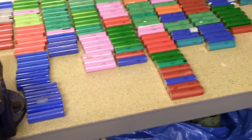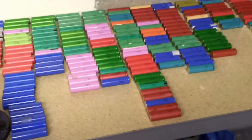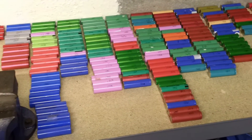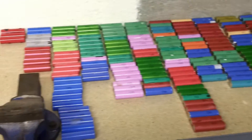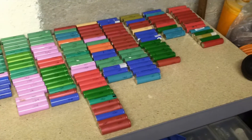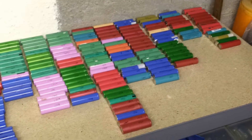I've yet to decide what sort of capacity I want based on the number of cells — it's either going to be 6 in parallel or 7 in parallel, times 2. I'm going to be making 2 packs; I've decided to go for 13 series and either 6 or 7 parallel, times 2. Each pack will be put in parallel to power the bike. I decided to do it that way because I could make 2 smaller packs and connect them in parallel — meaning I can just use one for a short ride, and I've got a backup pack if one destroys itself.